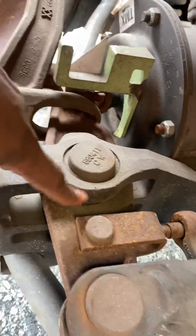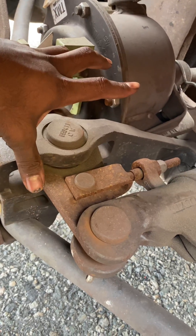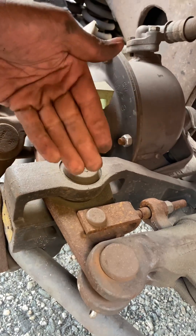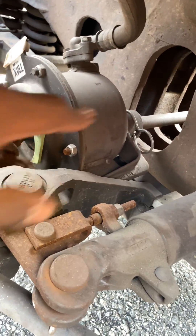This one's special — also look at the strut or the truss, it looks distinct. Usually with standard AAR brake beams they have a left side or right side, and it's a common brake beam, but this one is specially made for the TMX and the UBX.